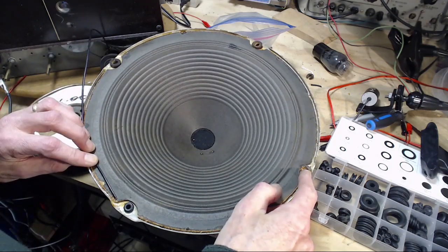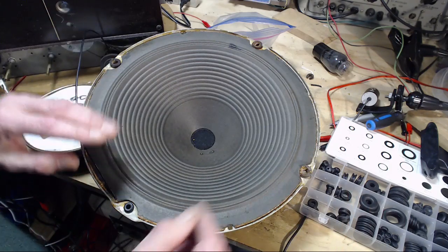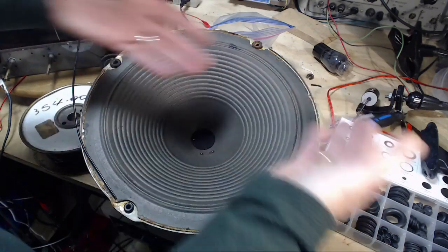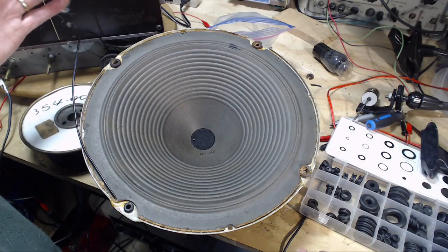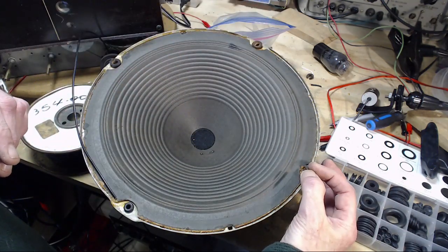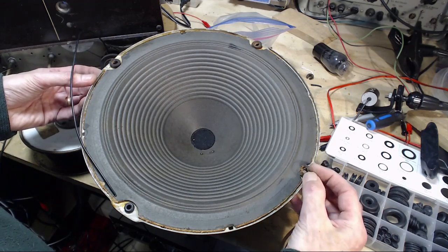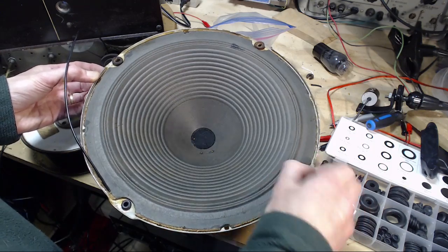if these grommets hadn't been under any pressure, they would probably be like new, more or less. It's the pressure on them, the squeezing of them, that generates the energy that drives the chemistry that ends up with cracked pieces here, along with other chemistry that's going on. There's gases in the atmosphere, all kinds of stuff happening. These things have certain components that are volatilizing off of them and the like. So the softer and more flexible things are, at least in this old vintage equipment, the more likely it is to fail.